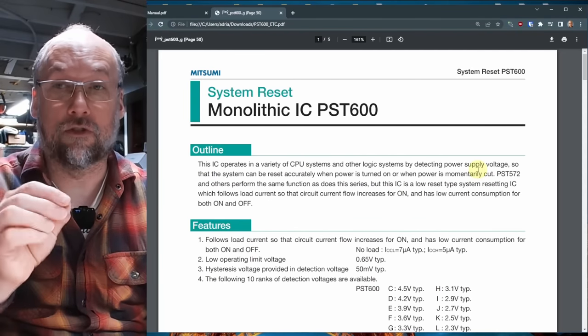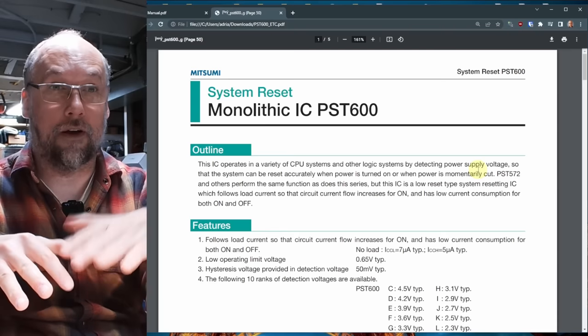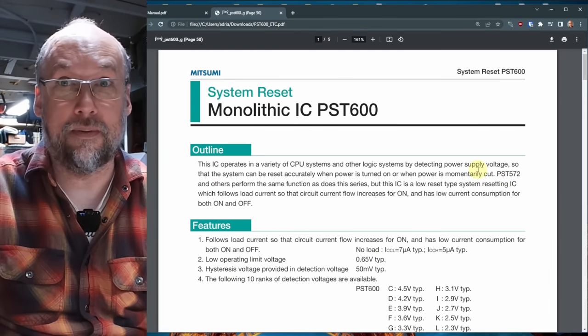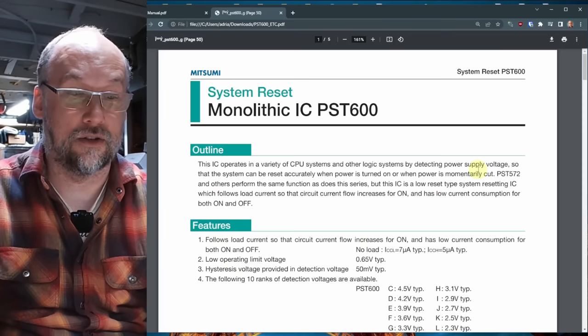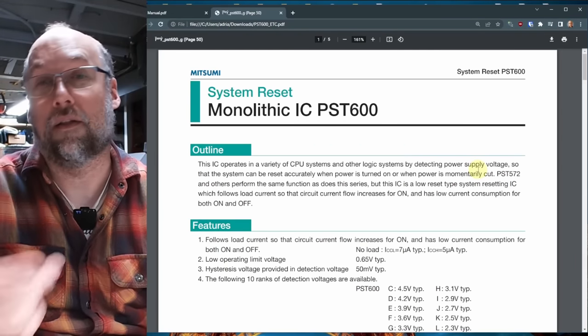When the microcontroller goes to start everything, there's gonna be a bit of a drawdown on the power supply. And maybe this IC here is saying, uh-oh, something's the matter here. And it's actually resetting the entire circuit.